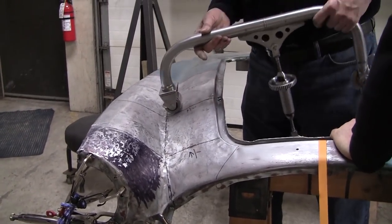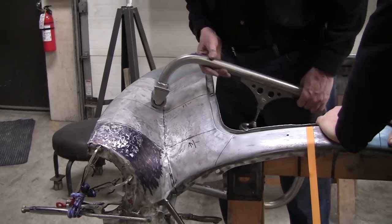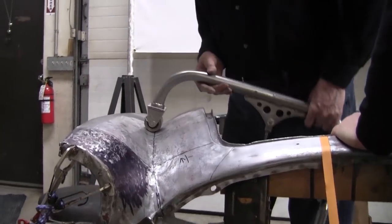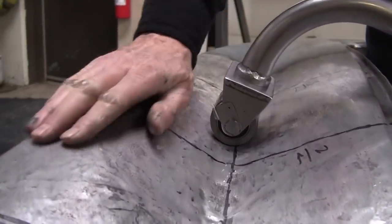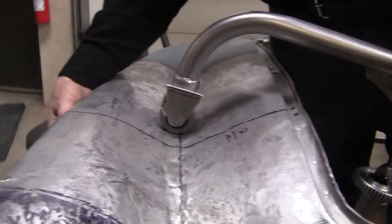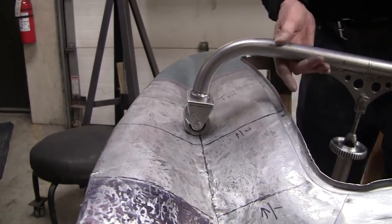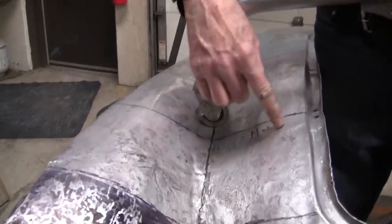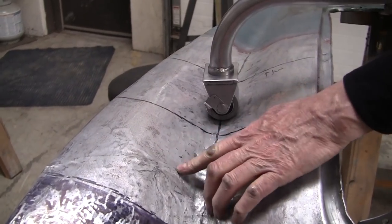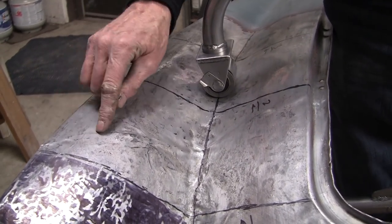Now I do have some experience with some of the early tools that are similar to this — these rolling mobile English wheels — and I found that they were really heavy and they really didn't do as good a job as I would hope they would have. Now you can see right here, I've got a dent that is going to have to be fixed by going this way, so that was going to require me to turn this and I'll be able to roll it here. We have some bolts sticking through — those are going to have to come out because it's restricting my motion right there. We might have to use the smaller wheels in a few sections here. And then you see, this is the factory weld, which got all distorted from hammering it out, plus the accident, and they filed it. So there's some weak areas here. As someone mentioned in the comments — and it was a good comment — in order to smooth that out, I'm going to have to grind that flush on the backside.